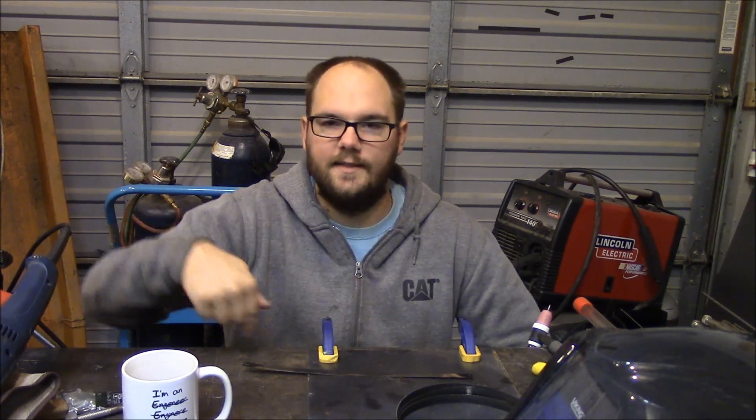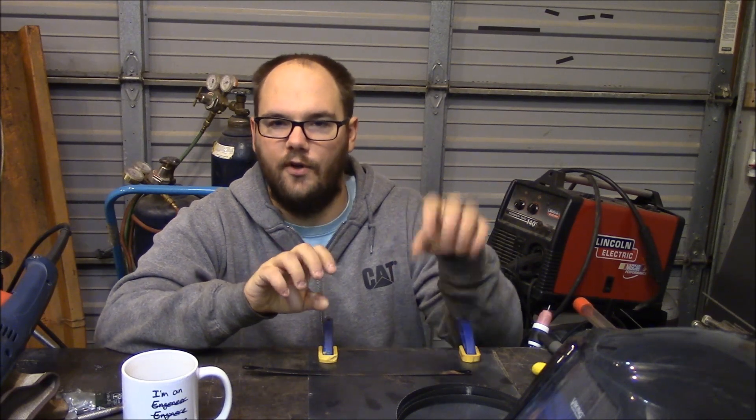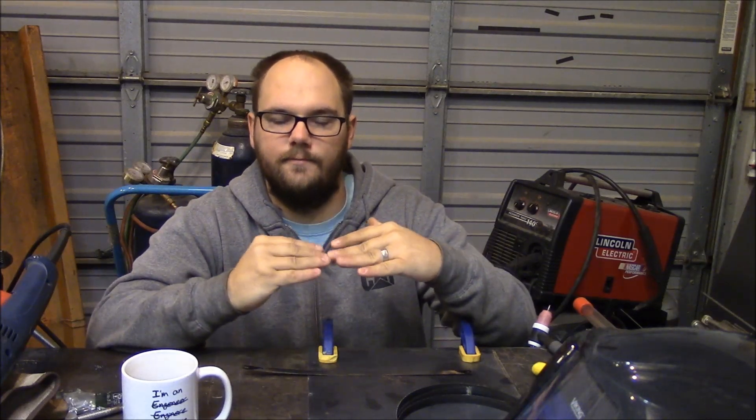Most vertical bandsaws are where you see people welding blades. That's because you'll have a part on the table with a hole drilled in it, and you want to cut out an inside design. You'll cut the blade, feed it through the hole in the part, and many machines have a little blade welder on the side. That blade welder is a form of resistance welding - it has a little grinding setup to clean the blade, then you clamp it in clamps that flow current through them, leaving just barely a gap so the electricity has resistance and heats the blade up. Once it's heated, levers let you move the jaws close together, upsetting the metal and welding it.